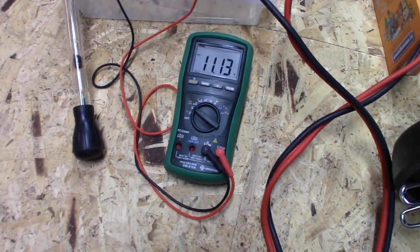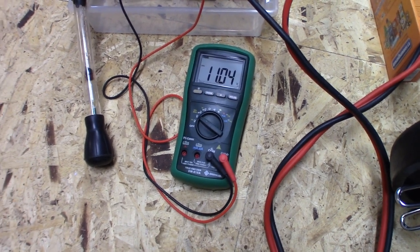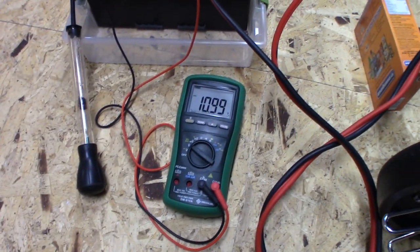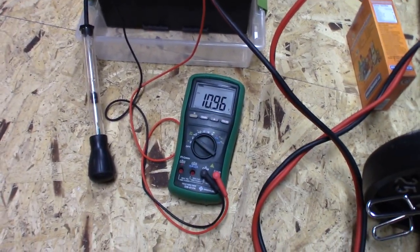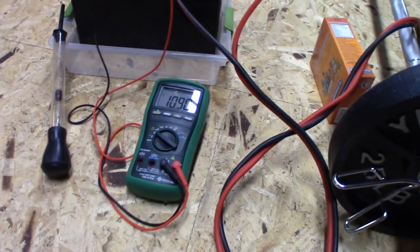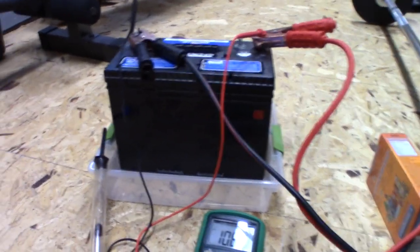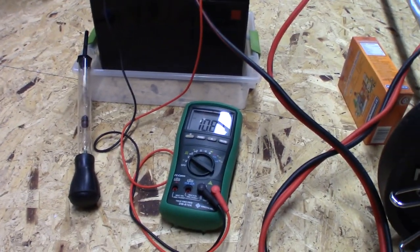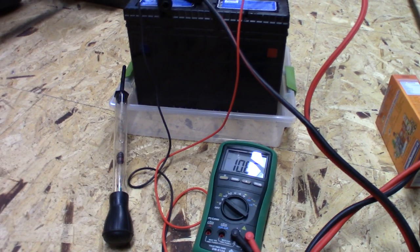That's because one cell is shorted — there are only five cells of the six that are actually active right now; the other one is essentially bypassed. When I say shorted out I'm kind of assuming it's shorted — it's very hard to measure the voltage of each individual cell. When I went to touch the battery I noticed it was kind of warm, and from experience I realized that something wasn't quite right. Heat in a battery — or a cell I should say, since a battery is multiple cells — means it's being overcharged. With one cell shorted, all five compartments were essentially being overcharged.